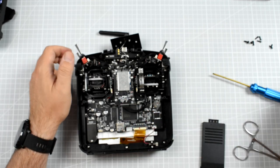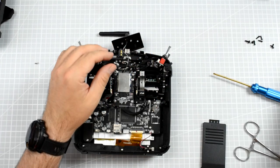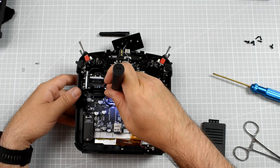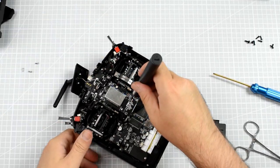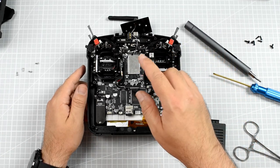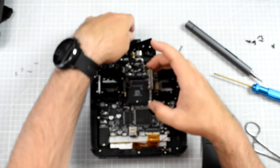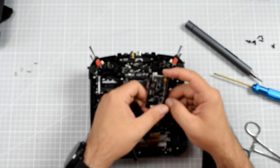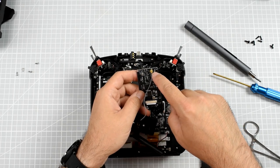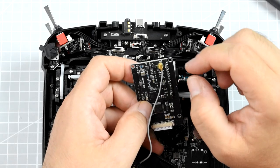I'm interested in this JP 5-in-1 module. Let's remove the 2.4 and find where they put the LoRa module. This thing is, according to Jumper, compatible with R9 ACC-ST but not ACC-ST Flex — that's not what I use every day. They put the LoRa module below the main radio module, and the antenna connector is on an IPEX connector. At least it's an IPEX — nobody had the idea to put it on an IPEX-4, which is just teeny tiny small.